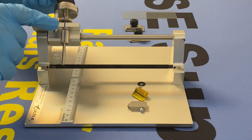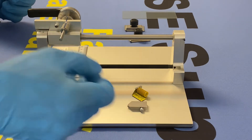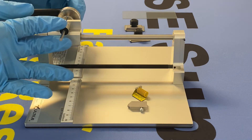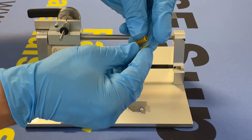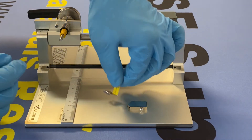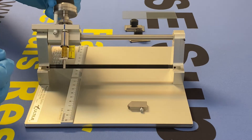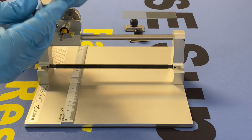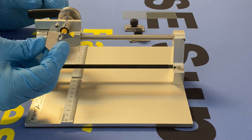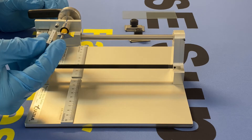You'll notice that all the blues are lined up. First thing you're going to want to install is this black washer — this is going to be your scale marker for when you're adjusting the tension for cutting. Next, you're going to want to install your tension spring and your tension scale. It's all magnetic, so it's not going to just fall off. And then your cutting wheel — this is a standard thin carbide cutting wheel, which is good for materials that are a half millimeter thick up to 1.3 millimeters thick.